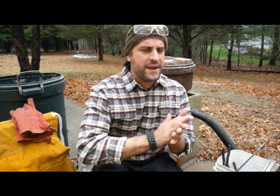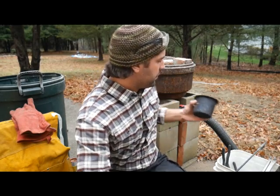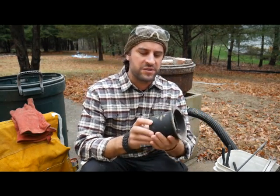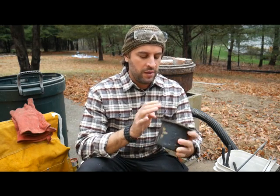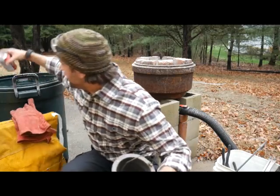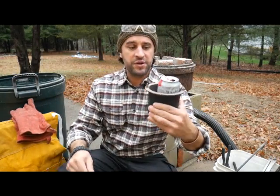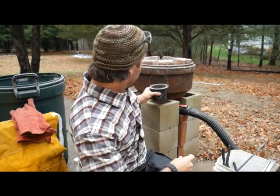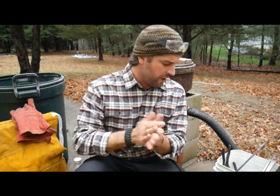So here's the plan. I've got several cast iron crucibles I got at yard sales, flea markets, and such. This is my favorite one — I'm going to use this to melt some cans down. It's a pretty good match, this will work wonderful. So I'm going to use that in my forge, get that forge fired up and ready to go, and melt down the aluminum.